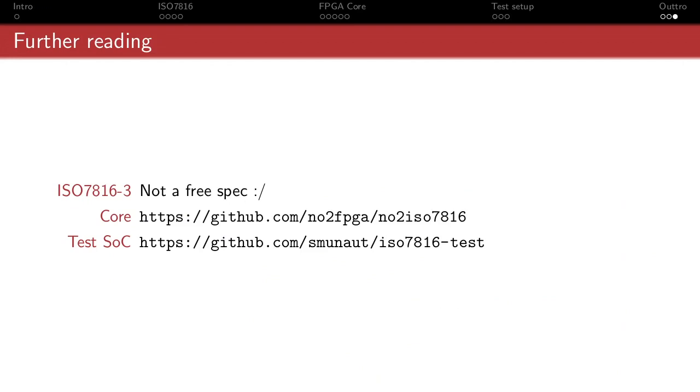But certainly for this application, the accuracy could be significantly reduced. We just need to know reasonably well in advance to send that extension, or one could probably even, well, but then you still need a counter if you do it completely inside the FPGA. I'm just thinking you could even automatically send that waiting time extension and not have a timer to report back to the software that something needs to be done. But then still, you need to count somehow the time that has expired.